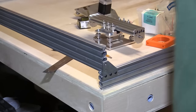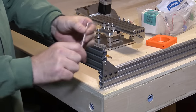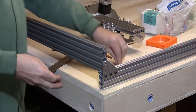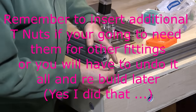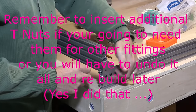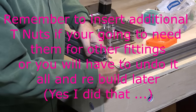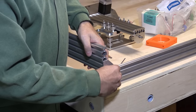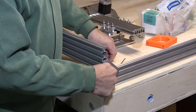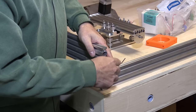Let me just grab the Allen wrench. I like these Allen wrenches that are long on one end so you can get good leverage without having to put too much effort in. You don't want to make these too tight though, because it is aluminum and you don't want to strip it. Don't tighten these bottom ones up yet until you've got the threads in — that way nothing is stressed or cross-threaded. By having it loose, you can pick up the threads easily and get everything screwing in, then go around and tighten it up afterwards.